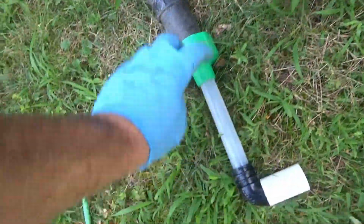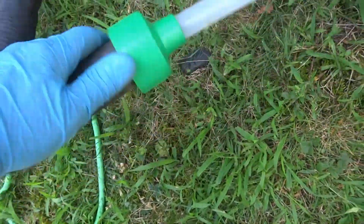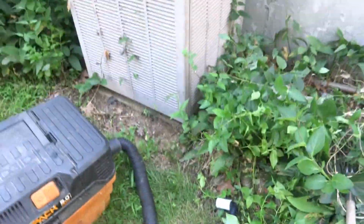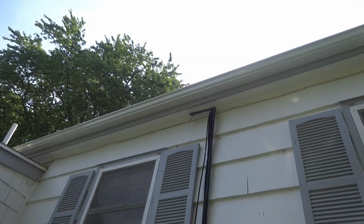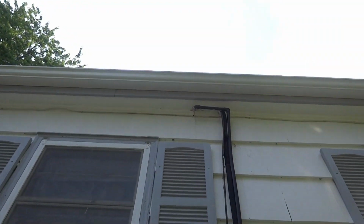We'll have to check the charge on it now. There wasn't a lot in that trap. Probably just icing up, or the pan's rotted. I'd like to get that clear up there, but I ain't gonna get my ladder out. Where's the thermostat? Over here. Now, I don't know if that pan is rotted inside the unit. I mean, it's an older unit.